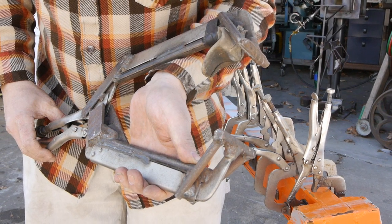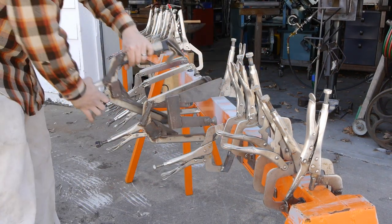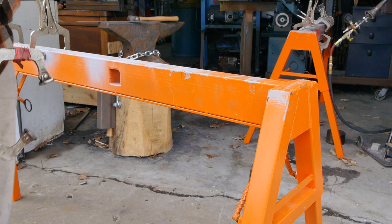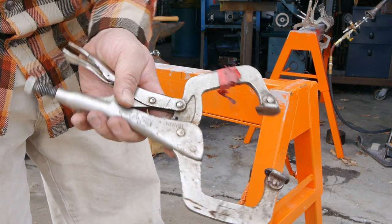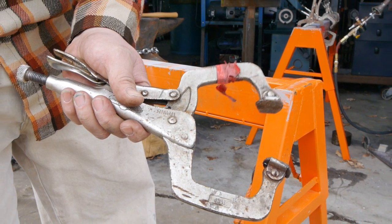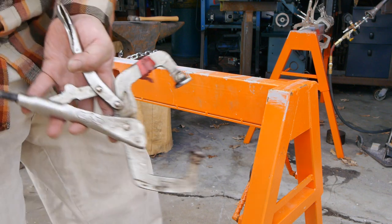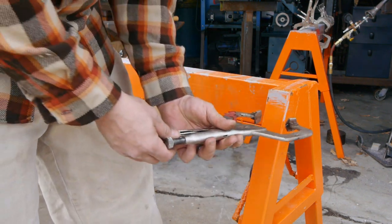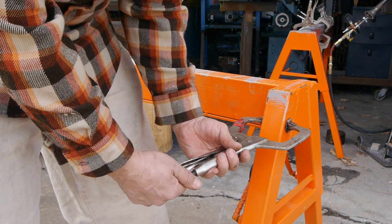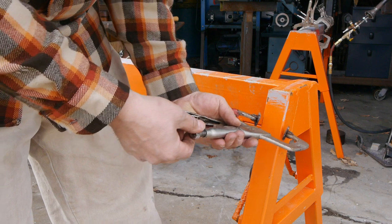It does come in handy to have long clamps that are also strong. So before we get into the more unusual clamps, let's go over basic operation of the locking C-clamp. This is a tip that was taught to me about 10 years ago by a public works artist named Jim Brenner. You start by closing the clamp onto your work, tightening the adjustment screw until the jaws close onto the work surface. Open up the clamp, turn the adjustment screw a little bit past a quarter turn, and you're golden.